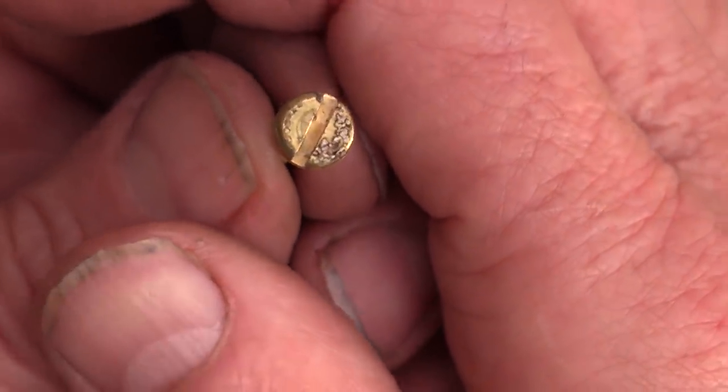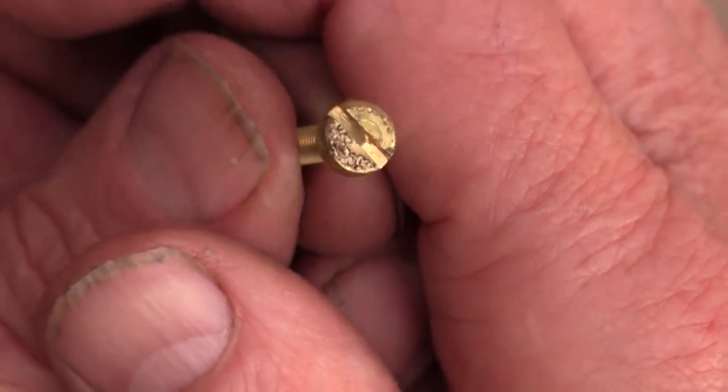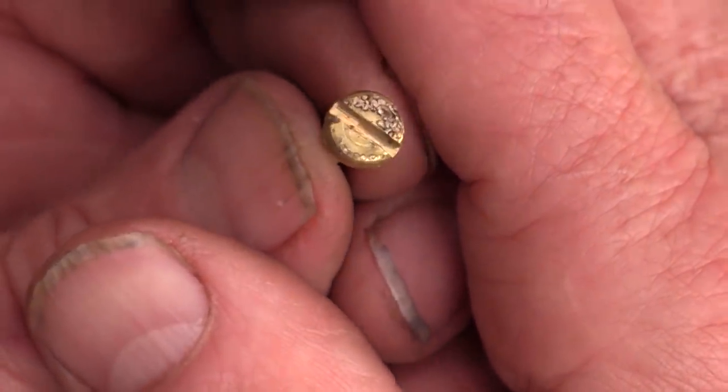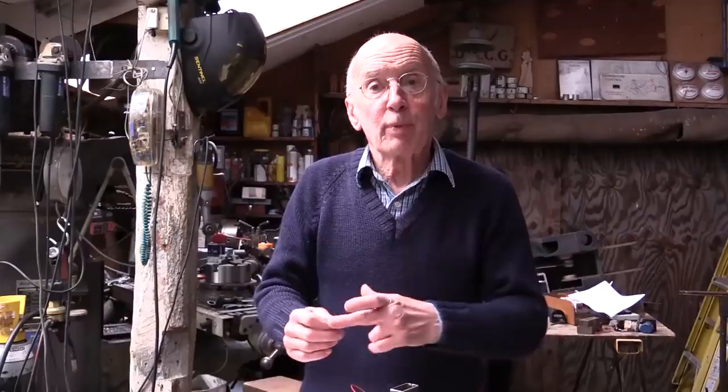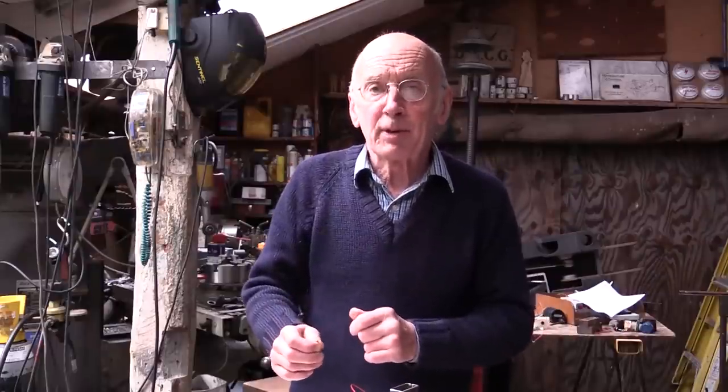This is the contact after switching the motor on and off a few times. It wouldn't be long before it stopped working at all. Or actually, more likely, it gets permanently welded to the switch arm. I've had that happen quite a few times.